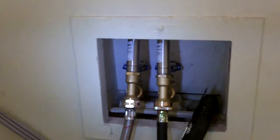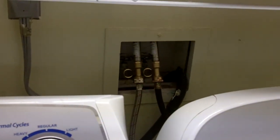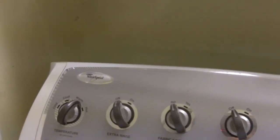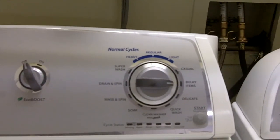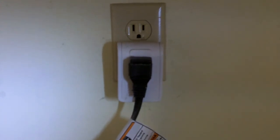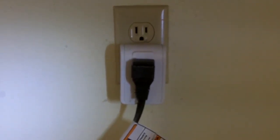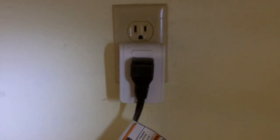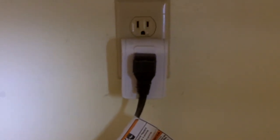We got a completed installation of these water hammer arrestors, both on the cold and hot water lines. It wasn't too bad except I decided to also replace the water filter on the cold line going to the washing machine, and clean out around and beneath the washing machine and dryer. Here's another project you might take on: get a surge arrestor and put it into the electrical outlet and plug in the power line going to the washing machine, since all washing machines nowadays have a lot of electronics in them. This helps protect your electronics and may save you a lot of money.